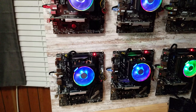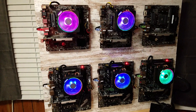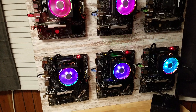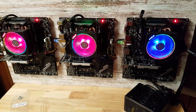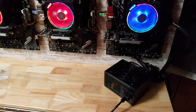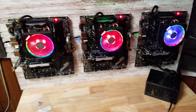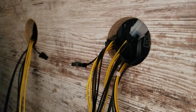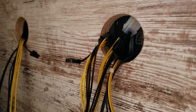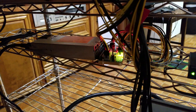I got these four motherboards all running off a server power supply right now, and I'm still waiting on two more Picos to come in. So I still have one still running on a normal ATX board. I got everything cut through on the board. I have the power coming up off this and then it goes into a Y splitter, so I got one powering the CPU 8 pin and then one powering the Pico. Then I got them all tied in down to the server power supply, which is a 750 watt unit.